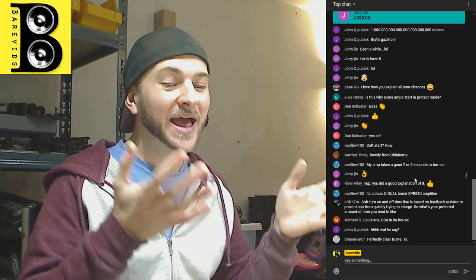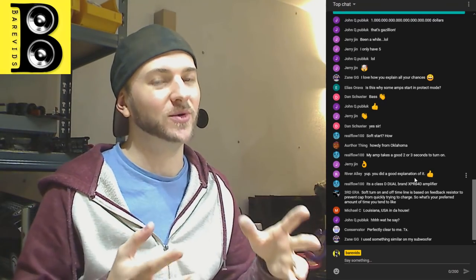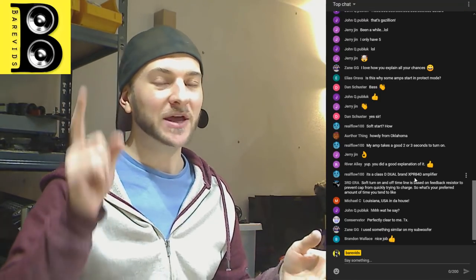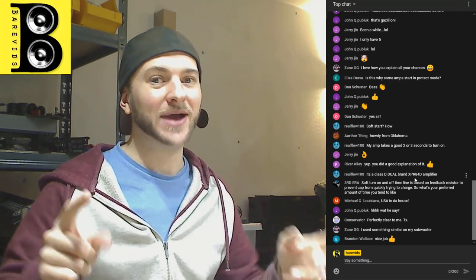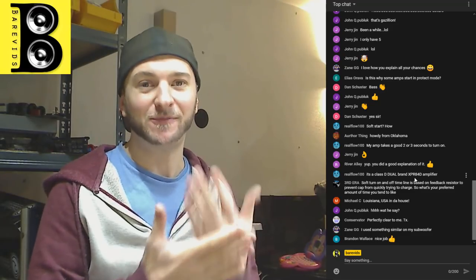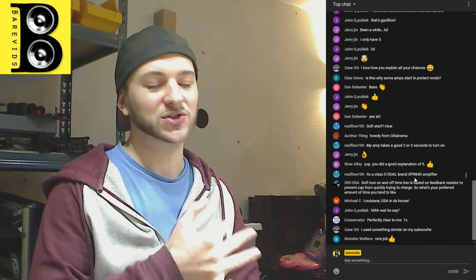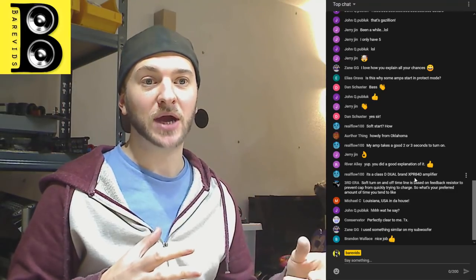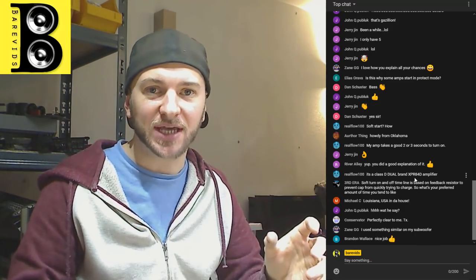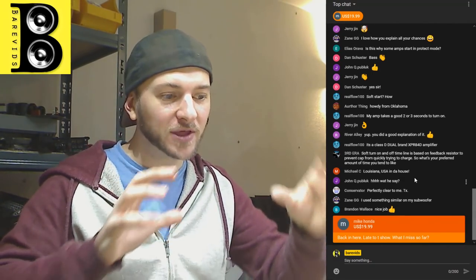Now, some people might assume that while the amplifier is in this kind of pre-powered protection mode, it's doing a health check. For 99% of amplifiers, that is not the case, even though it might look like it. There are some amplifiers that go through a health check mode before they turn on fully, and those are the Brazilian amplifiers. This is why I have a big respect for Brazilian amplifiers, the new stuff that they're bringing out: Taramps, Stetson, Banda, Sound Digital, etc. When you first apply the remote, the power supply sends a couple of tiny pulses to the output section, which builds a few volts of rail voltage. By doing this, the amplifier can check the health status of the output section.